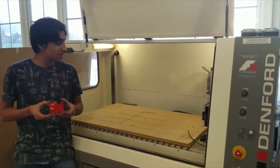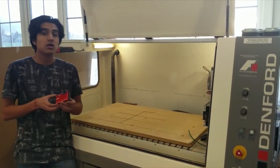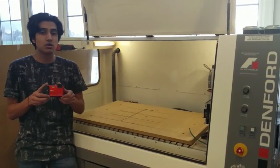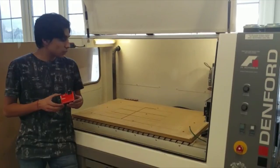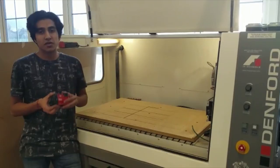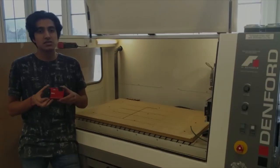To make the skeleton we are going to form a mould out of MDF using the surface of this camera. We're then going to vacuum form high impact polystyrene onto that MDF to create a bracket for the camera so it can sit comfortably inside.